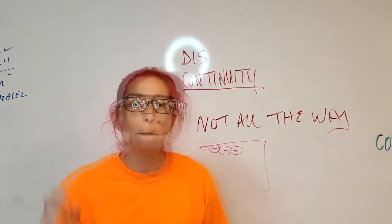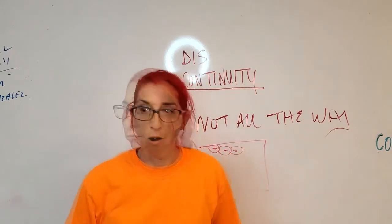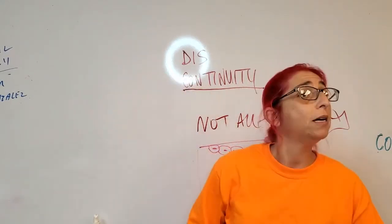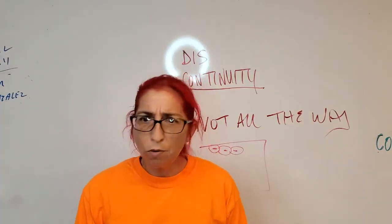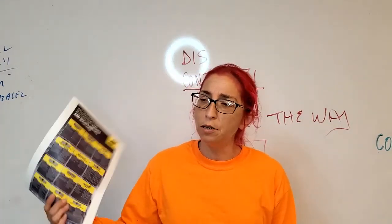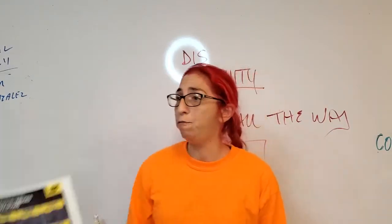It will not burn out. No matter how many people say, oh, don't worry about it, you'll be fine. It's lies, I tell you. A lot of old timers will say, don't worry about it, you're okay. But then really think about it, then why do we have slag inclusions? Because somebody didn't worry about it. And when you have enough of these, your part fails.